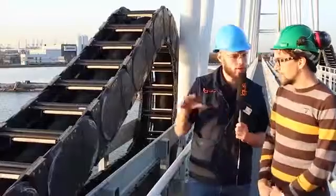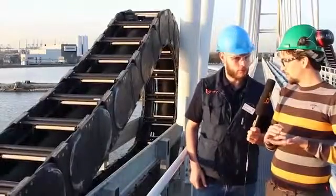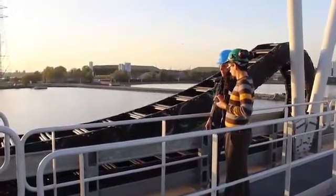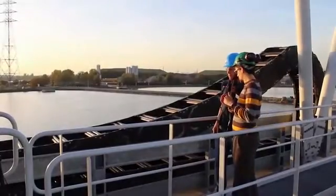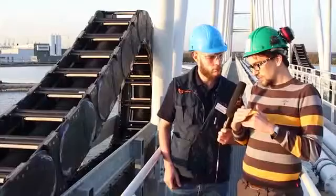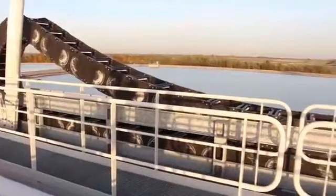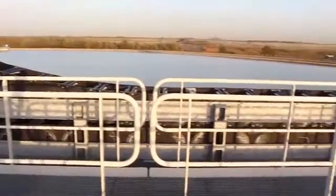What is this all about? Because it's like a mixture of E-Chains and bearings. Well, the hose and the chain have different thermal expansion, and when the hose is under pressure it expands a little. Because the hose is moving relative to the chain, that movement has to be supported, and therefore the bearings are there to help the hose glide in the chain. That's the main reason.